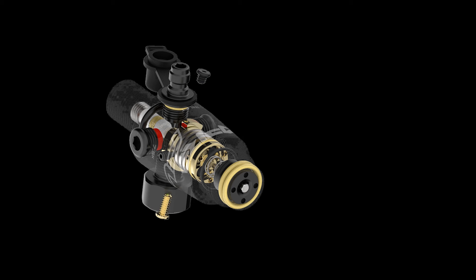I created an externally adjustable output pressure adjustment via an internal cam system. The cam increases or decreases the spring tension on the stack and does not have to be disassembled to do so — it's as easy as taking one socket head cap screw from one side of the body and installing it on the other.